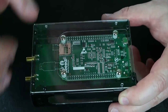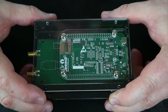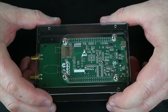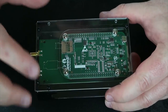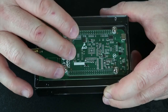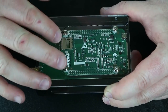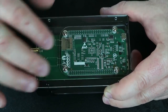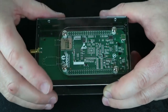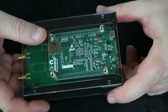On the back you've got the BeagleBone board and an SD card slot. Don't make the same mistake I did — the SD card is for emergencies only. Keep it safe in the box; you do not need to put it in the device. Unlike a Raspberry Pi, this takes the card, installs the software onto the BeagleBone, and then you remove the card. The information it needs is already pre-installed on the board. I installed the SD card, it completely ruined the device, and I had to reflash it all and start afresh.